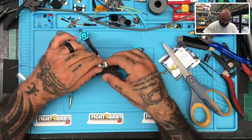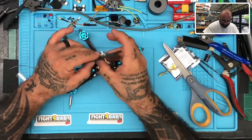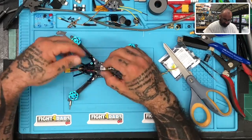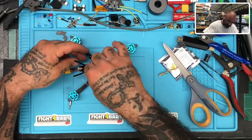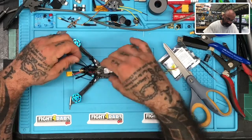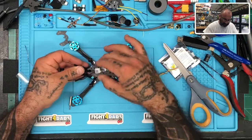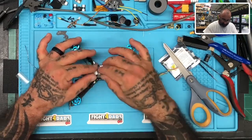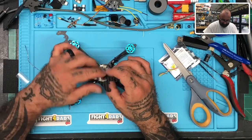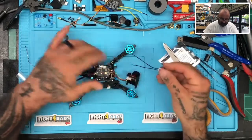Plan your layout here — even if I lay it out this way, wires will fit just fine underneath. You can tuck it, run these down, come back up here, just like that. Then you'll be able to heat shrink these on the outside and you'll be just fine. We will not have our receiver against any of the heat from the VTX. Good — now let me just disconnect this thing to get it ready for heat shrink.